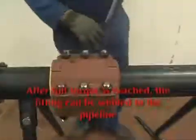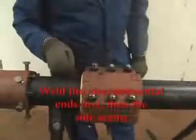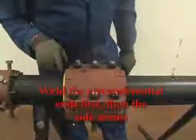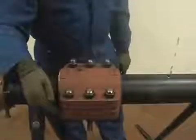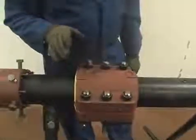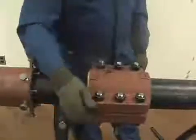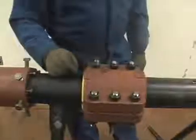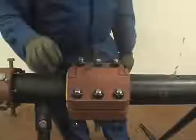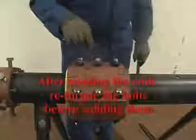Now that we're fully torqued, if desired you can weld this to the pipeline. We say to weld the circumferential ends first, and then the side seams. Some company policies say weld the side seams first, then the ends — that's fine. Our first concern is making sure the pipe is anchored. If there are no structural integrity issues with the pipe, then you can weld the side seams first; it's not an issue. What's important to remember is that after welding, the weld contraction will take some of the load off the bolts, and it will be necessary to re-torque the bolts prior to welding them.